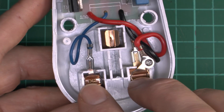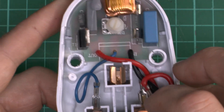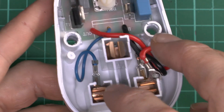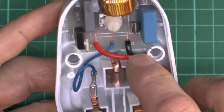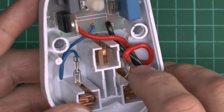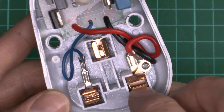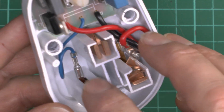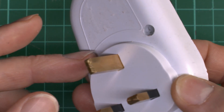In terms of what we've got in here, it's pretty straightforward. We've just got the line in and neutral here, coming straight through from the pin on the back, with wires connected going off to the actual board at the top. The neutral is just connected through for a reference, and the actual switching connection goes through the board. The line here has a connection at the bottom going up to the board, and then another one comes from the board back down to the connection at the front socket. The black wire is the line input — a rather odd colour choice — going in to the board and back out to the thing you've plugged in. No direct connection between front and back for the line, whereas the neutral is solid all the way through. And no active connection to the earth — that's just a straight-through pass from the pin on the back.